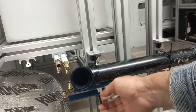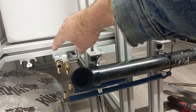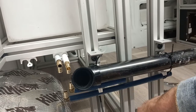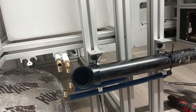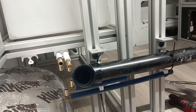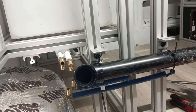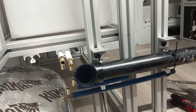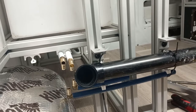A zip tie will hold these pipes together. I'm using my little clip system to hold the hot and cold water pipes, and the hot and cold pipes below are also held with the clip system, with the modified clip behind the inch-and-a-half drain pipe. There's another small clip here that will be for supporting wires going back to a tank monitor, power for the pump, and probably an auxiliary outlet at the back for a receptacle.